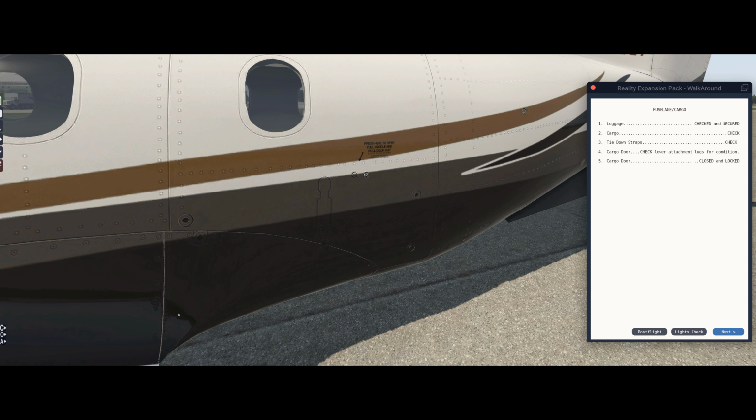And you want to make sure that you have that because the nitrogen system is there to keep the gear pressurized at altitude. So the PC-12 landing gear does not have any uplocks. When we climb up in altitude, the gear is just held up by hydraulic pressure. You're going to lose a little bit of hydraulic pressure, and if you take off with not enough nitrogen, the gear is actually going to sag out of the wells a little bit in flight, and you don't want that to happen because it's going to give you a lot of extra drag.